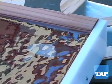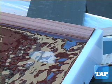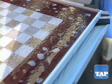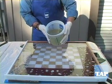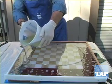Allow the resin to gel but not fully cure. It is at this gelled stage that the next layer can be poured. You can test for gel with a stir stick. You will also see the resin turn wavy on the surface, indicating the curing process is progressing. Pour the next layer during this gelled stage. Our resin took about 1 hour to gel.